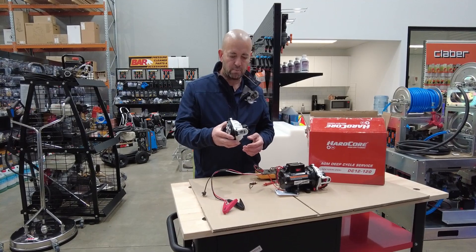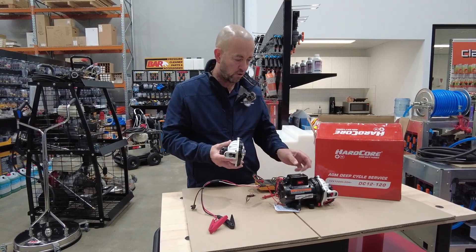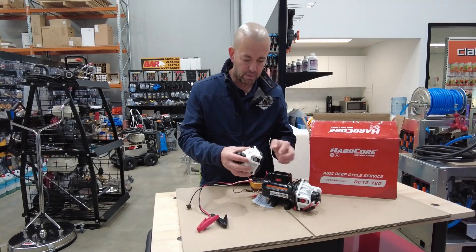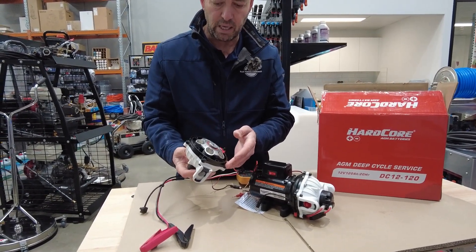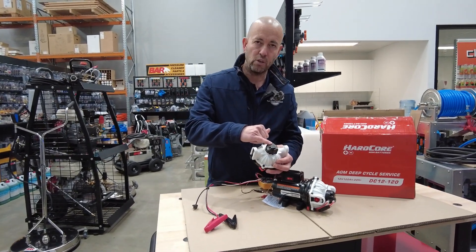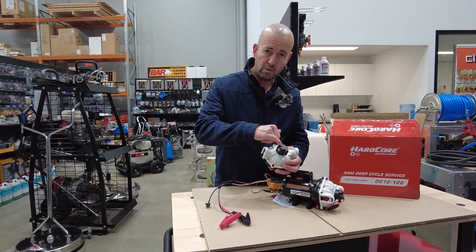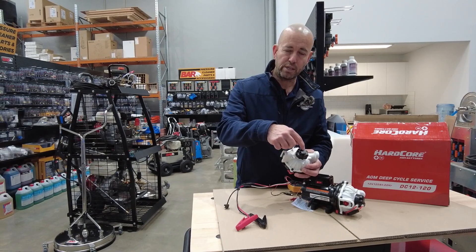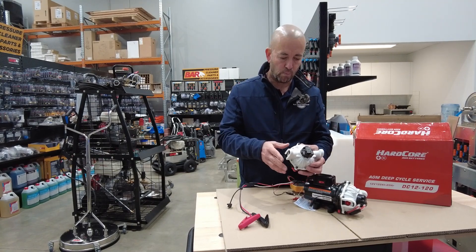I wanted to give you tips to make it easier with your soft wash equipment. The cartridge assemblies are pretty similar on all units - there are five bolts, often allen key bolts, and you'll get an allen key with the pump. To change a cartridge assembly you remove the silver screws on the end. The cartridge also has a pressure switch which can be adjusted - using a very small allen key you can play with that pressure switch to get the pump running continuously to satisfy the parameters of flow and pressure in your particular circuit.